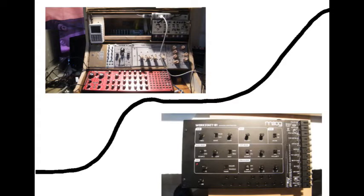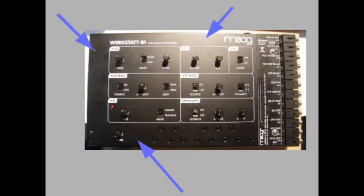Well, seriously. The modules of my hybrid modular synth do communicate, as do the modules in my Moog Werkstatt. The common and shared ground of the modules in the Moog Werkstatt is simply the metal case, like I mentioned before. All ground connections in the circuits are connections to the metal case. The common and shared ground in my hybrid modular synth is delivered by the Eurorack power supply. Those of you who have seen video 6 of this series know more details about it.